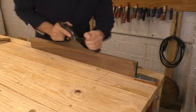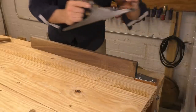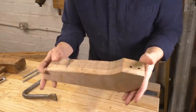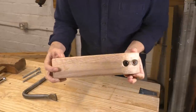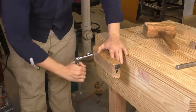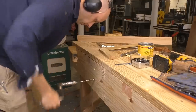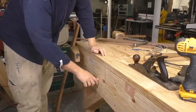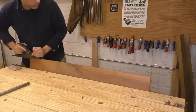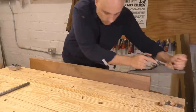There are some other places where the planing stop won't do everything. It handles the edges of narrow boards, but for edge planing wide boards there isn't enough support to keep things balanced. To fix this problem we need a crochet — it's just a hook made out of hardwood. I made this one entirely with hand tools and I have all the details in my low bench series. The end is drilled and there are washers in the holes, making it easy to just bolt to the leg of my bench. I'll also drill some holes in my apron and these will hold pegs or holdfasts to support work in the crochet. My crochet has a long narrow taper and it really grips the ends of boards while the pegs support the weight, so the board is held really nicely for edge planing — no vise necessary.